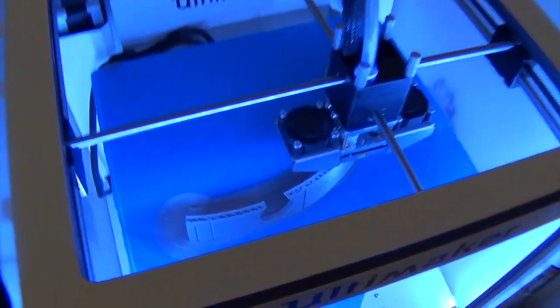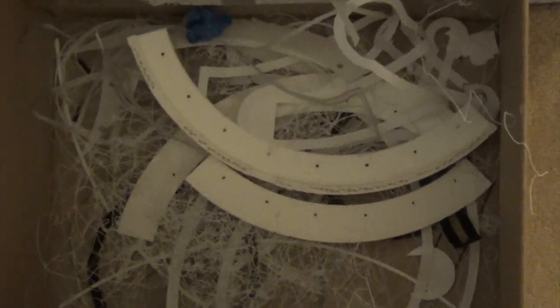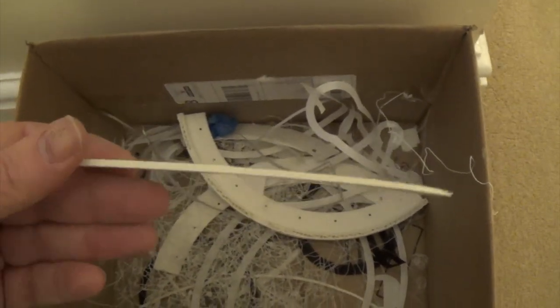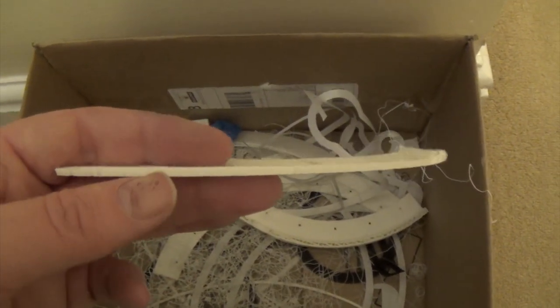The 3D printer's busy whirring away. I've had four unsuccessful shots at making part of his dome. This is ABS. ABS is notoriously hard to 3D print - the problem is it warps as it cools. The nozzle temperature is 255 degrees C roughly, and the print bed is about 100 degrees C. What happens is, as it cools, the right-hand end started to peel up - it just lifts away from the glass and turns up as it cools. Then the whole thing goes skew-whiff during the middle of the night.